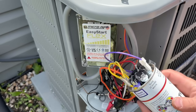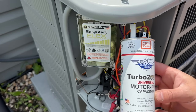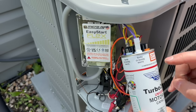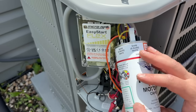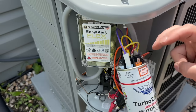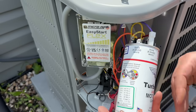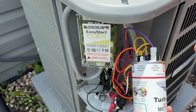These Turbo 200 units are about $100 or a little less, but it's money well spent because it covers you in any situation no matter what capacitor you have. It will also work on a capacitor in your furnace — those typically just have two pins, a common and a 5 or 7.5 MFD. So if your furnace goes down in the middle of winter, or your air conditioning fan stops running in the summer, this can save you in that type of event.